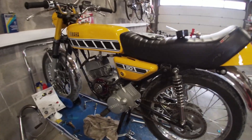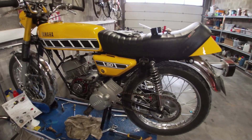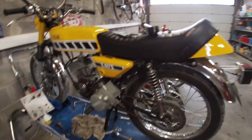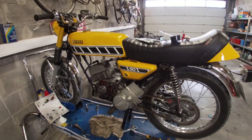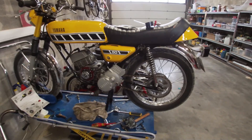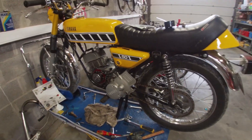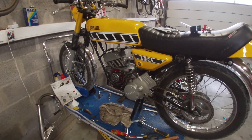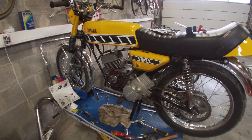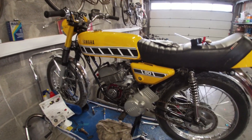Welcome back to another episode. As you can see, Kenny is back on the bench again because recently after rebuilding the engine again with the new crankshaft, I think there is a small air leak at high load. At higher RPM the engine struggles and actually leans out, so I think there might be a small air leak which only occurs at high RPM or under high load.